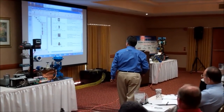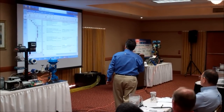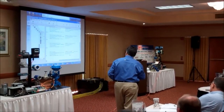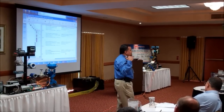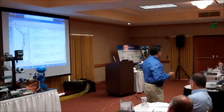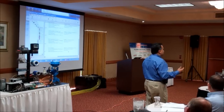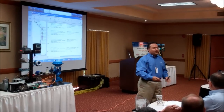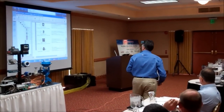Now you can see the actual device that I have put on the segment. This is the manufacturer ID, which is Fisher Controls, and this is the device type. But the device revision is 01. When I configured this device during offline engineering, by mistake I selected device revision 2, but my actual device is revision 1. So the first thing we need to do is match this, and then Foundation Fieldbus has a website where I can go and download the correct DD files, which will make my job much easier.